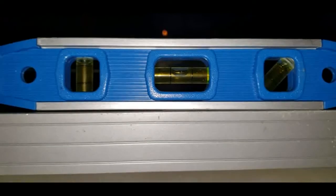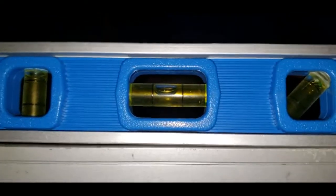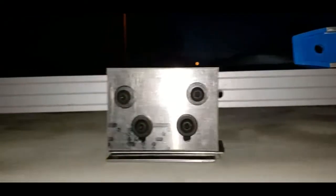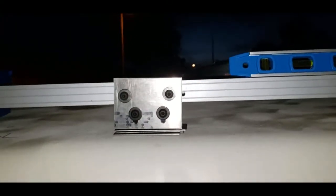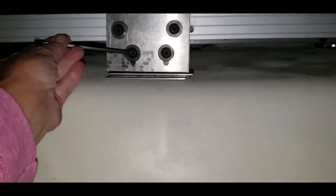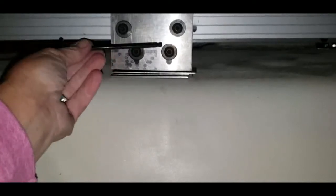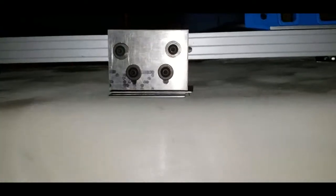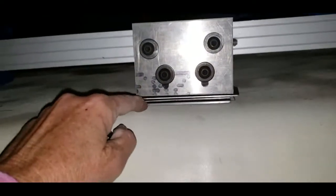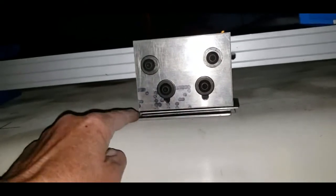Alrighty, MacGyver Sharon back. I got the first panel set up. Look, so that's front to back. Here's the MacGyver Sharon adjustable solar clamps. Loosening these with these slots levels it this way and this way. This will be the plate, and I've got the super thin plate pretending to be the butyl tape.